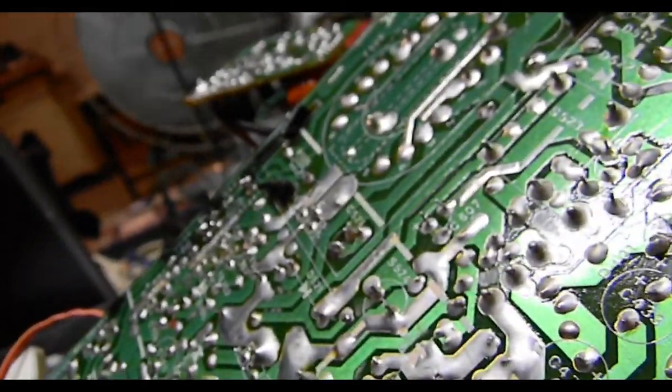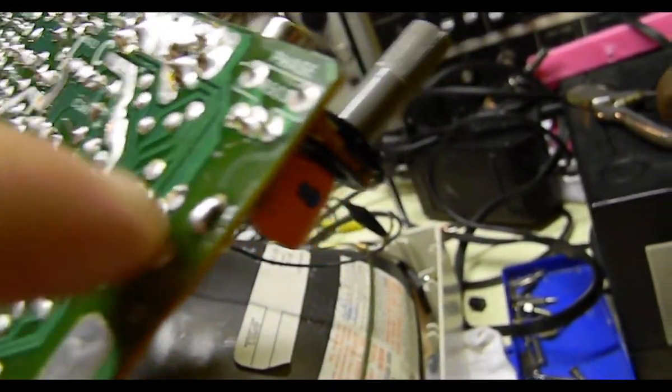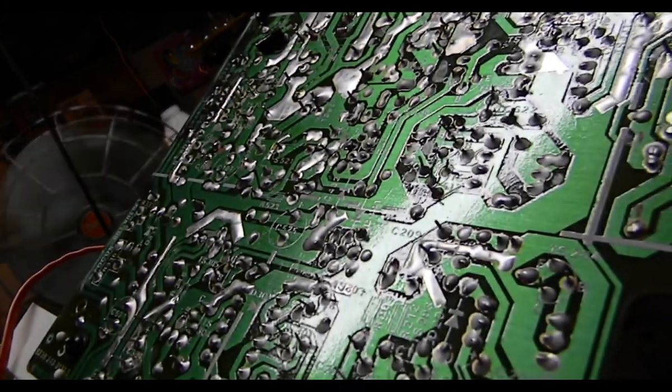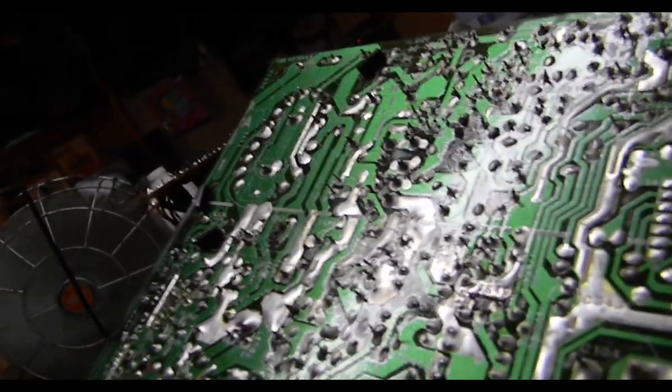This thing has to work. I don't know if you can see, but that looks like it is completely free of connection to the emitter on this transistor here. I'm gonna keep inspecting this thing and repairing. Found a sketchy wire over here and I got a nice blob of solder on it going over to the next one. I repaired my connections there. That's right next to the flyback. On the other side it's mounted on a heat sink — that is the horizontal output transistor. I was having problems with the power coming on and off, and problems with horizontal deflection. So there's a good probability I just fixed my problem.